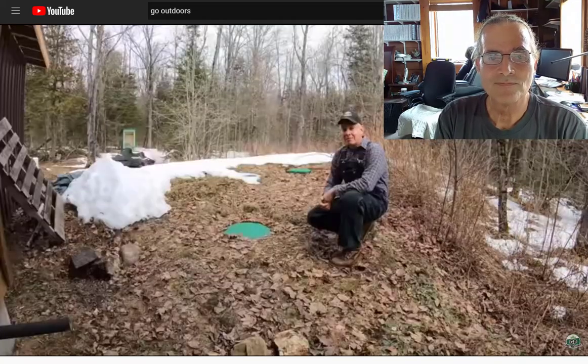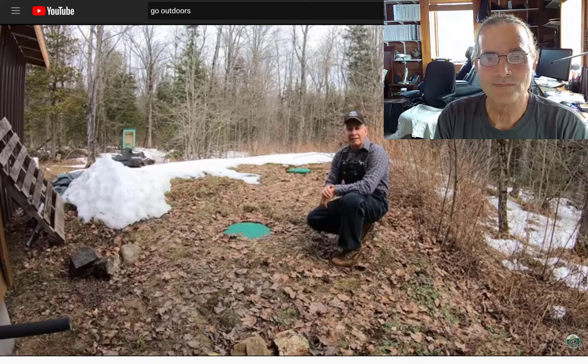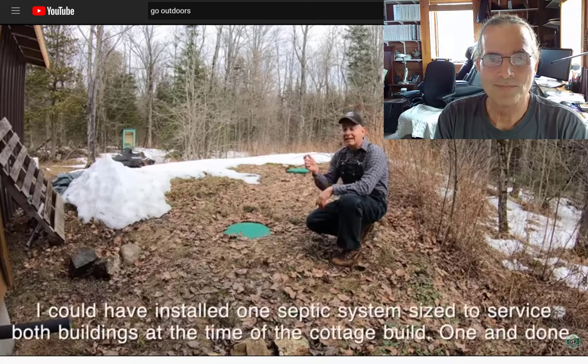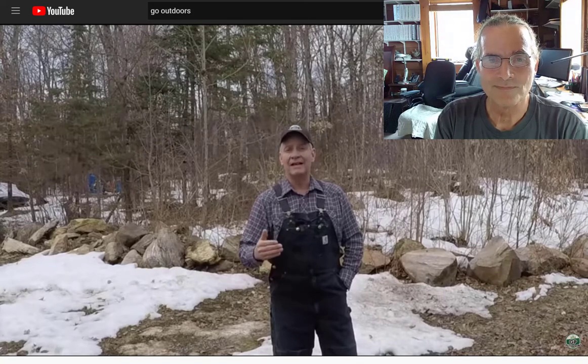My septic bed up here will run you about $20,000 to $23,000 from start to finish. The septic bed is sized to the cottage. I always expected when I built the garage I would have running water and a bathroom, and I was hoping to have a second floor up there — throw a few beds and maybe a bathroom for guests. But I can't tie into this one. Bylaws here require a separate tank sized to any other living quarters or dwelling, because it's no longer a garage — it's considered a habitable dwelling. That's another $20,000 at least, plus a brand new permit application process, engineering designs, and all related costs. Materials cost a lot more after 10 years, and trying to get labor in a building boom is going to take a while.